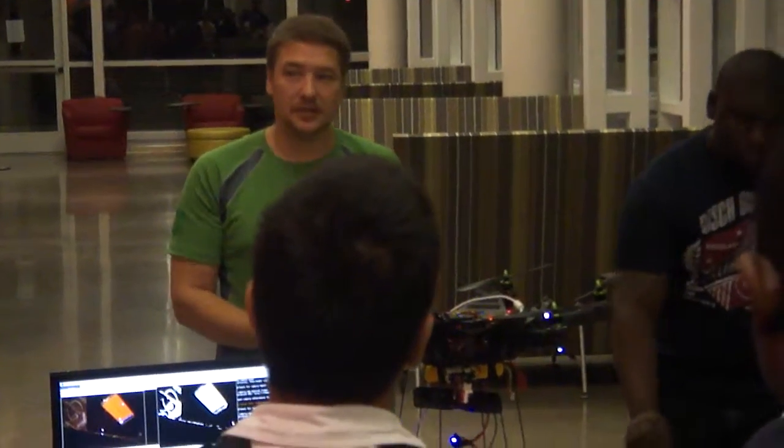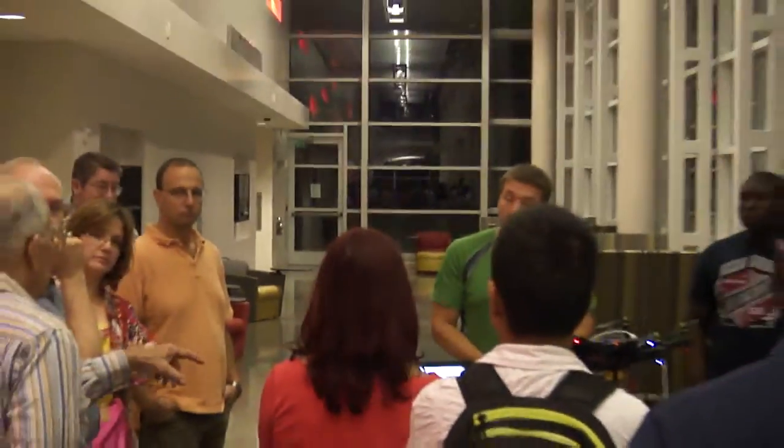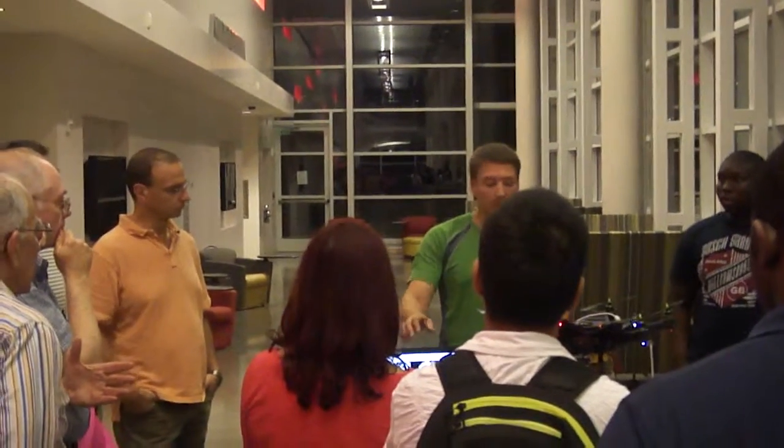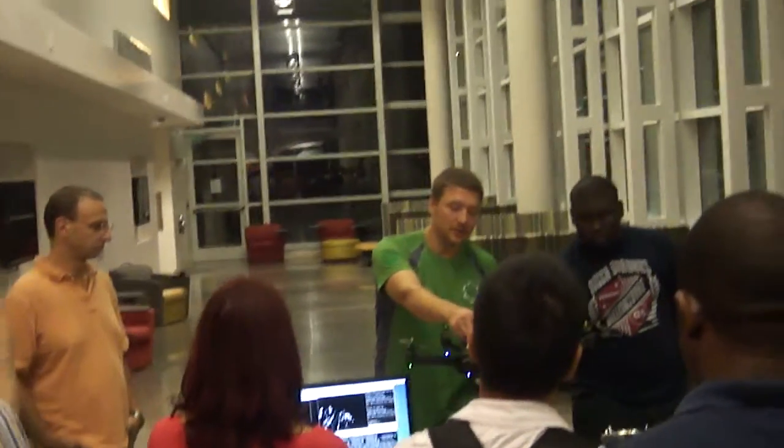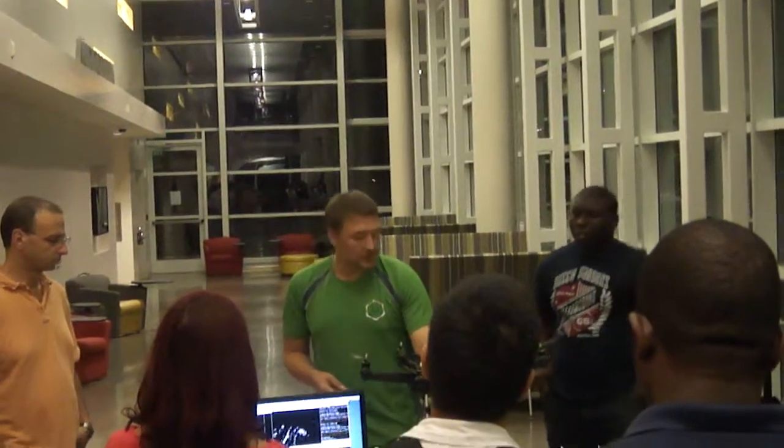Anybody have any questions? Does that give you a view on a screen while it's operating? It flies autonomously, so it doesn't relay anything back to the ground station. Well, it can. When we fly competitions autonomously, we have these things set up on a network. At our ground station, we set up a computer, and as long as it's on that network, we use a program called Robot Operating System. Our camera stream is sent onto Robot Operating System on the network, so any computer that has it can see what the robot sees in real time. So we do give some real time information back.